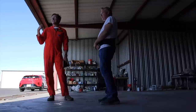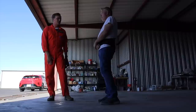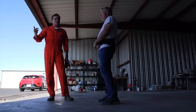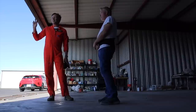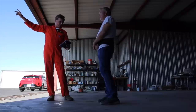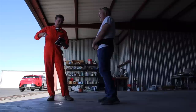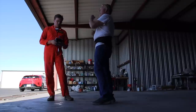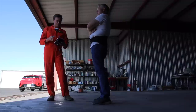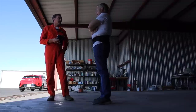Anyway, so leaned for the taxi. Came back on the runway, it was full black knob, full blue knob, pump on for takeoff, 16 gallons per hour peak fuel flow, gear up, power back to 2500 RPM and around. Peak CHT was 395, and that was cylinder number two. Cylinders three and four were both in the 350 range. And cylinder one never came above 270, 280 all day.